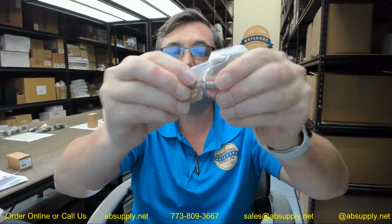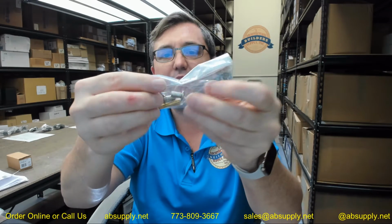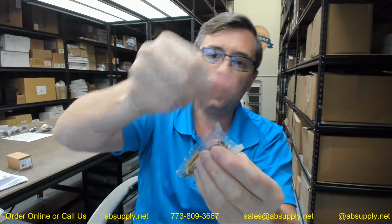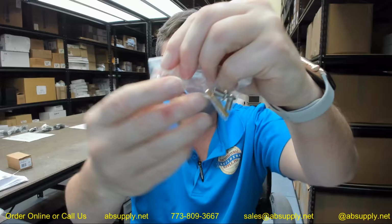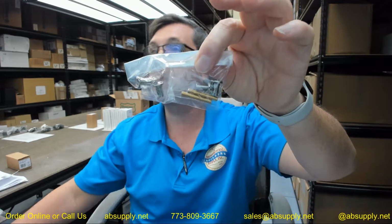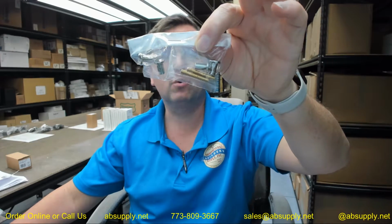You are indeed going to get security type fasteners. You might call these a binder post, I suppose. You're going to thread one end into one side, and the bolt will come through. Be real careful before you're installing these. These one-way screws are generally not very conducive to coming out. That's another reason why everything has to be ordered the proper size, because the length of those bolts will also be in relationship to the thickness of the jamb. This client ordered a door thickness of 1.25 inches and a jamb thickness of 1.25 inches as well.